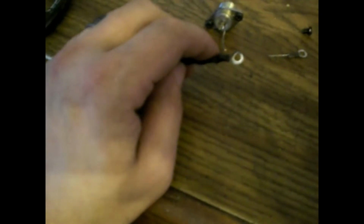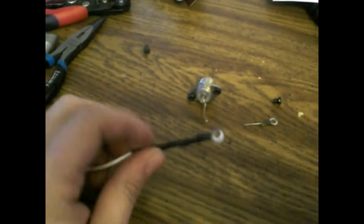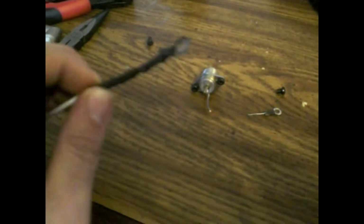I purposely cut these wires a little bit longer so this way I can shorten them up. And the main antenna wire is about 110 inches long, and I did that on purpose, as I said, so that I can tune it. So once it's tuned, it's done. I don't have to worry about it.